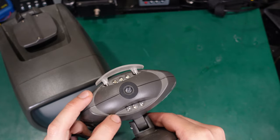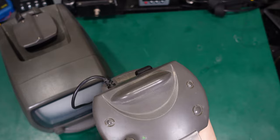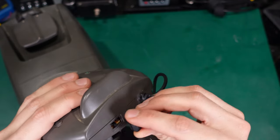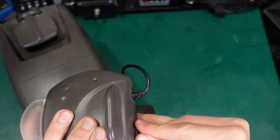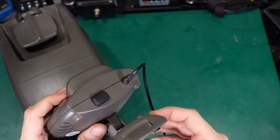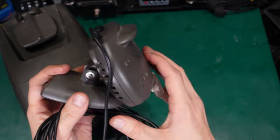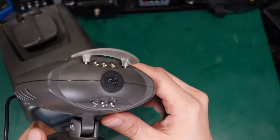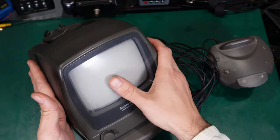We've got infrared LEDs, and that's because this device can see in the dark. We've got the antenna on the back and a switch — this switch allows us to choose a frequency channel, so if we're unlucky and we've got a Wi-Fi router working in that area, or we've got a second camera, we can try to change the frequency. This is the camera looking very nice. Of course the lens is pretty terrible, but you don't need anything great for a black and white small screen.